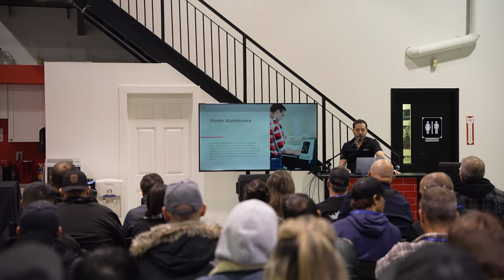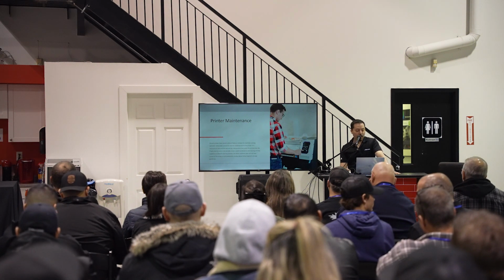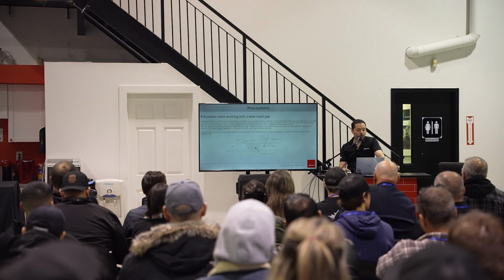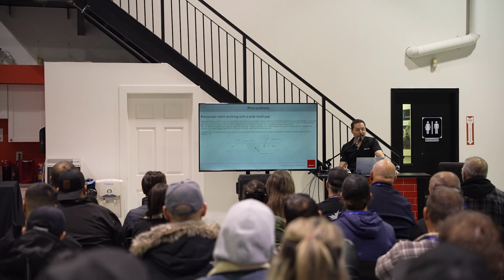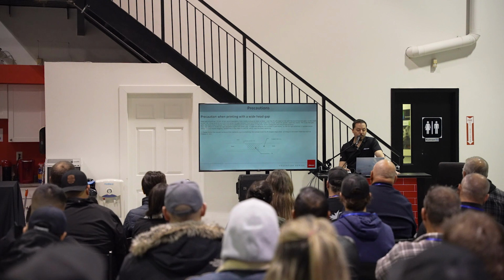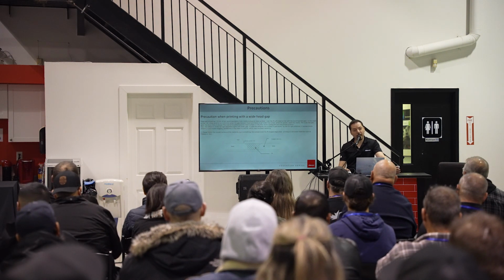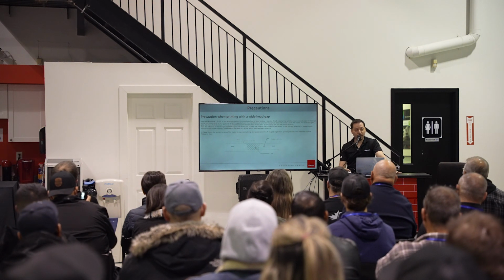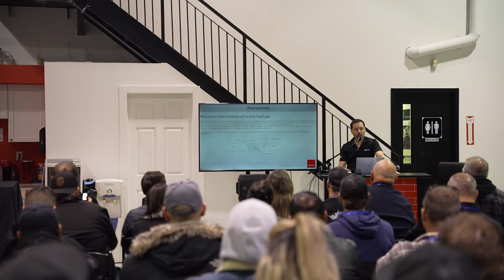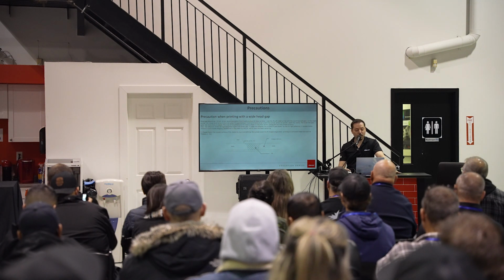All right, so printer maintenance. So we're going to kind of go over some of the features and the maintenance that'll need to be done on the TxF printer. So just to give you a little slide here when you're printing with a gap, so there's some head heights on the machine. What will happen is if you're printing too high from the film, this is where you're going to start to have some dot misplacement. You can actually have some ink come back onto the print head, which is more maintenance for you, so you want to make sure you're printing at the correct height. The machine automatically prints at a 1.5 millimeter distance from the media, so there's no need to go too high.